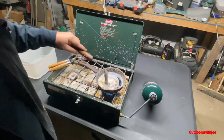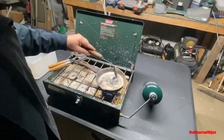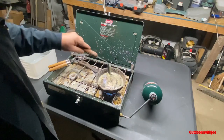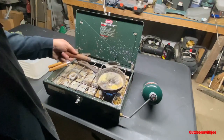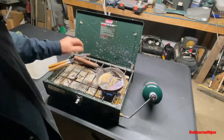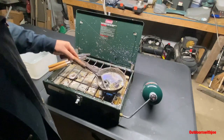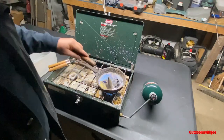Slag is just getting the dirt out. Just stir it up a little bit more, get it worked around real good. You can see the slag is in the bottom and all inside of it — stir it, pull it around. And that does help your ladle — let it sit in here and warm up so it doesn't stick. Get nice and warm. See there's more slag that came out by me stirring it up. Get this slag out, put it in my bucket, stir it up a little bit more.